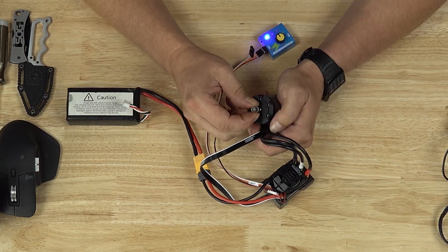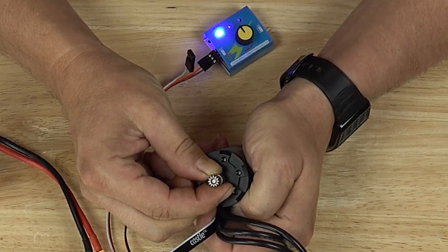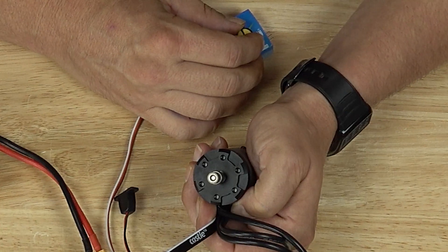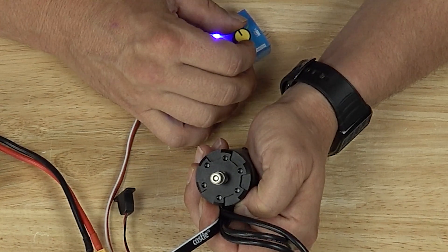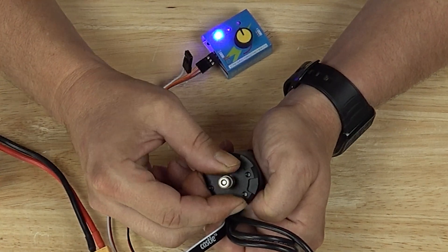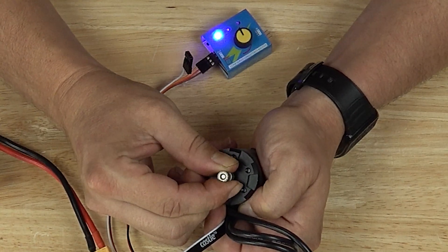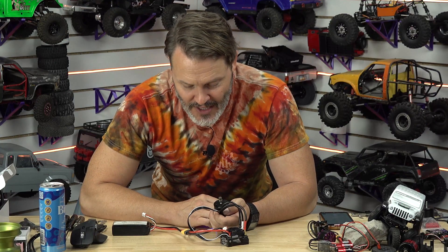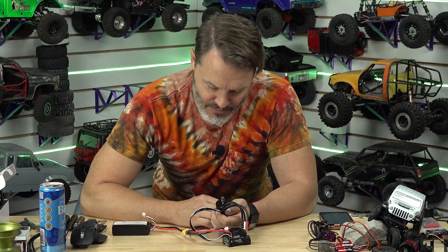As compared to previous versions, the restart after a stall is really smooth. As it loads down, it's keeping excellent sync — of course, when it switches from startup mode to normal operation. This is unloaded, so you're going to have more RPM variation since there's not an RPM lock. Once you get into an RPM range above the startup, it gets very quiet — pretty much just commutation frequencies that you can hear.